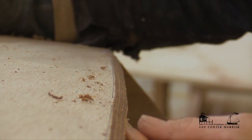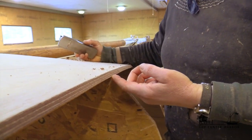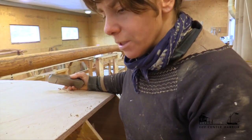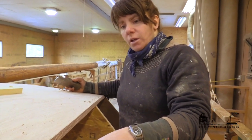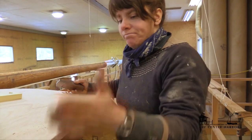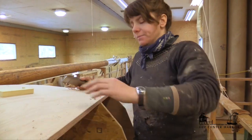It is quite important here to make sure that you're not removing this bottom corner, because that is your plank line. If you're anxious about it at all, you can take a marker or red marker, something like that, that will make that little corner pop, because you do ideally want to bring this to a feather edge, and when you're trying to do something like that, it's really easy to make that edge go away. And then you can end up with some waviness in your plank lines.